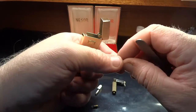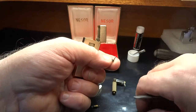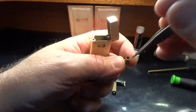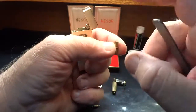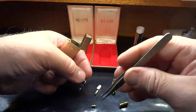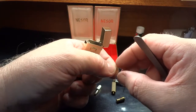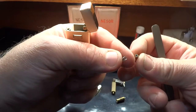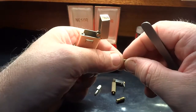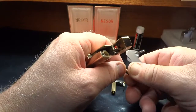This is the assembly here. Right here I put a new O-ring on the stopper pin. Sometimes you gotta hit it to get it down that hole. Then on this valve here, there's a smaller spring. It's got a little bit more tension to it than this spring here, and I cut a new stopper seal right there. So you'll fit that in like that.